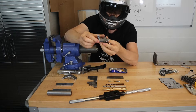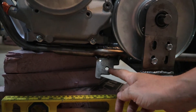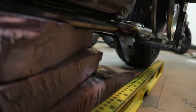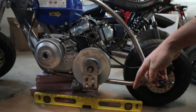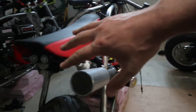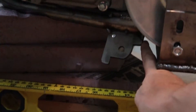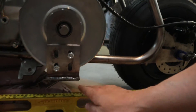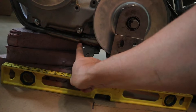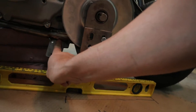I take a 5/16 inch bolt and I'm going to be bolting that in place — later I'll be coming back and welding things in place. I want to show you the placement of where I'm mounting that so you can get a feel for the angle. It's not straight up and down — it's actually coming out at about a 35 degree angle. I've got two places I can mount it: one centered on the frame and one a little bit further back. I've measured 13 and a quarter inches from the back of the frame to where that kickstand will be welded. I tack the front first, play with the angle, position it properly, then do your second or third tack and weld it into place.